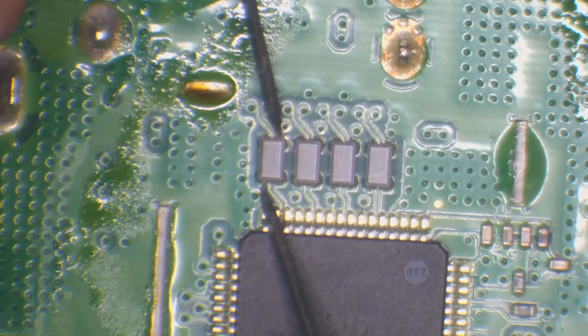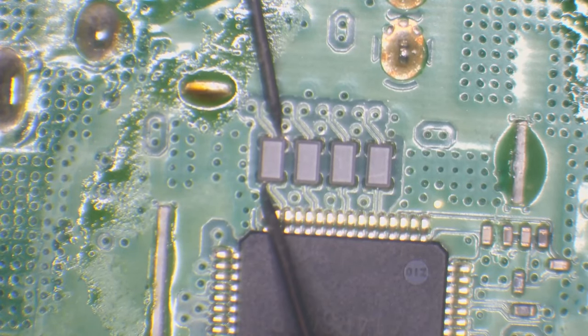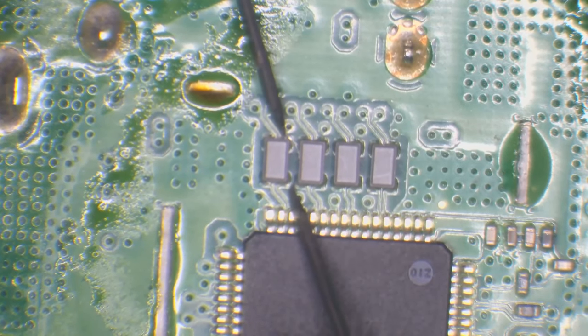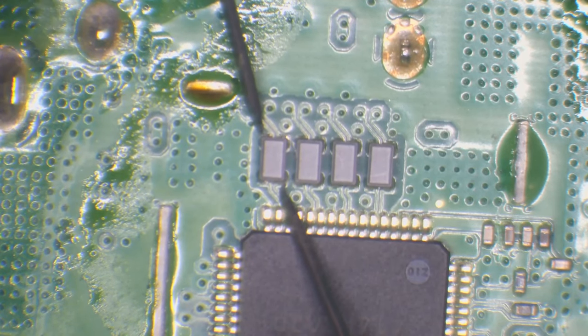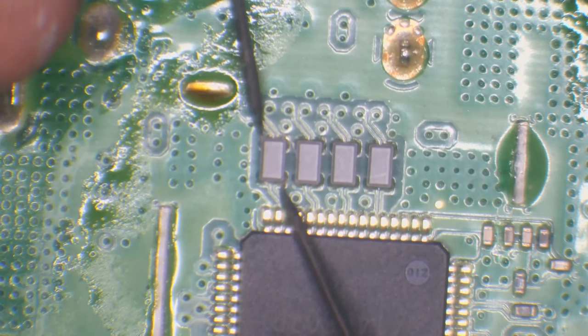However, we have got a resistance of 130 ohms from left to right. So that filter is definitely reading incorrect. So you can see we've got continuity, and we haven't got continuity that side, but like I said, we do have a resistance reading there. That should be open line and it's not. That's reading as 124 ohms and it's dropping.